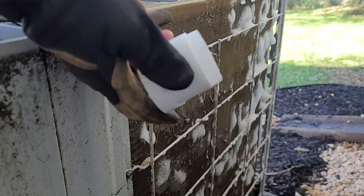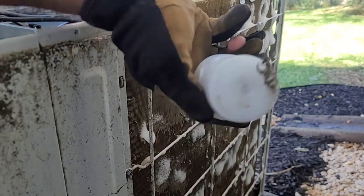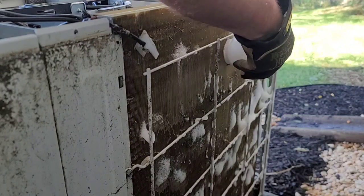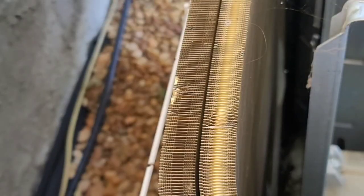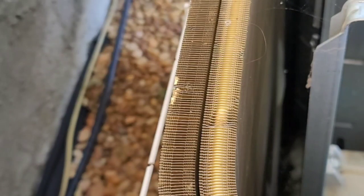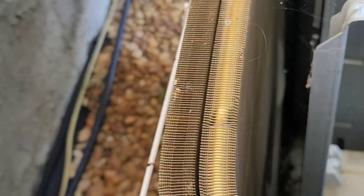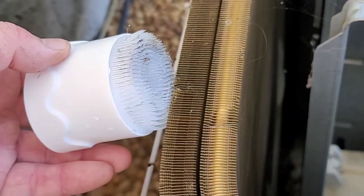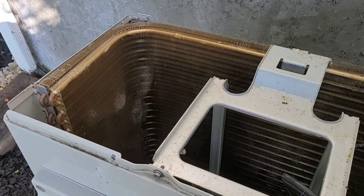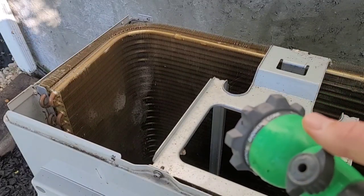Because it's been a significant period of time since I cleaned this, I'm going to use the brush head to gently go up and down the grates. Look at that dirt that just came off — a lot of dirt. Make sure you're doing this very gently with no pressure; I'm just using it to scrape out the vents. I tried my best not to mess with the coils because they are very sensitive and soft, but I did hit one. What I'd do is take the brush, gently line it up, and pull it back into shape — go very slow, don't apply too much pressure. This has been sitting for about 20 minutes now and most of the foaming cleaner has dissolved. I used an entire can on this one unit, which is what I typically do.